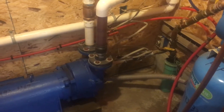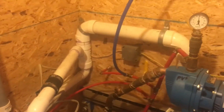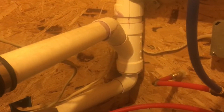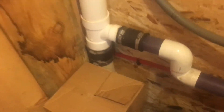Water comes in over there with that yellow valve from a dark spring — the pump needs the water. You can see the water going back out that line. That three-inch line is actually the vent line that goes back down and outside — that's just the breather hole for the exhaust air. The water goes down through that three-inch to two-inch adapter and the 45, and we have a trap right here to help with noise and slow the water down a little bit.